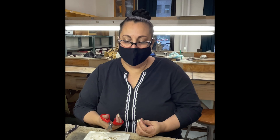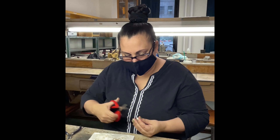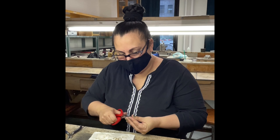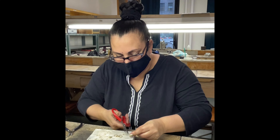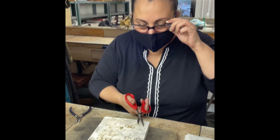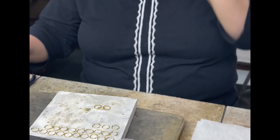Another way you can go wrong is cutting too big a piece of solder. If you have a lump and try to clean it up, it never really looks right. The key is: if you cut one piece and melt it and it makes a lump, you know you need to dial it back — calibrate as you go. If you start getting lumps, readjust. Start with that small piece and if it's a little too small you can calibrate from there.